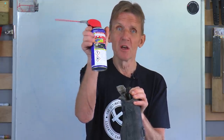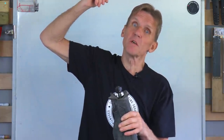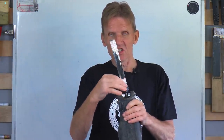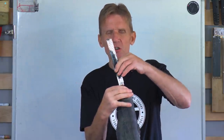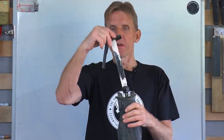A lot of people were saying, 'Did you fix it? What was the problem?' I think what had happened is that somebody who had used this saw had probably left it out in the rain or damp. So what I did — a little bit of WD-40 down there, which I'd done before I started messing around, by the way. That was my first port of call. There aren't many things that WD-40 can't fix — maybe a broken marriage, but a lot of other things it's pretty good at. If I'd actually gone and drunk the cup of tea my wife had just made me and left the WD-40 to do its bit... When I went to put the blade back in — a genuine Milwaukee blade, not aftermarket, amazing blades — it goes in perfectly now. Absolutely solid. Slip the shoe back on, you can actually do it with the blade in place. Pretty good.